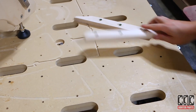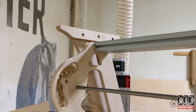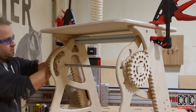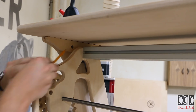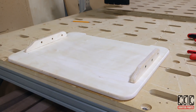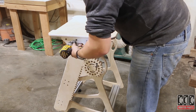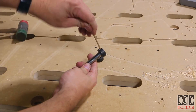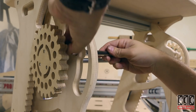The tabletop attaches to the moving legs using cleats which I'm pre-installing on the moving legs. I'll position the tabletop, measure the overhangs, center and align it, marking the position of the cleats on the underside. Then I'll fasten or glue the cleats permanently to the tabletop and install the table using six M8 socket head fasteners.